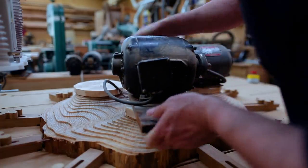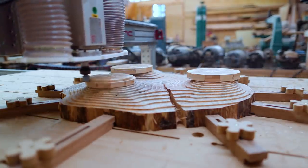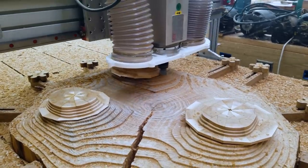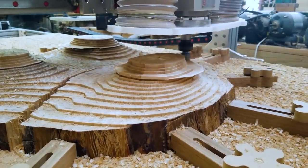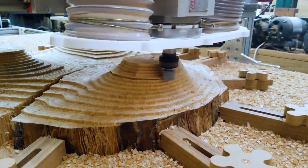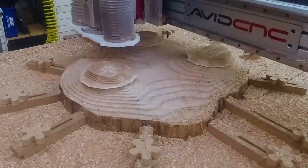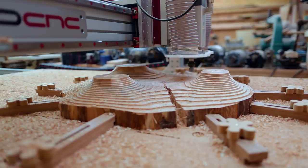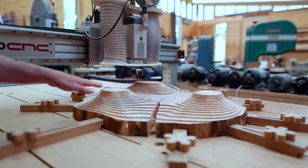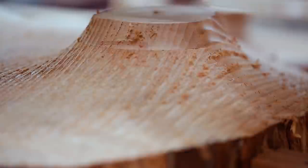Then I ran the roughing pass again. The first time it had been cutting air where the new material wasn't there, but now running it a second time it's actually hitting the tops of the legs I just made. Once I got through that new material I stopped the run — I didn't move the piece of wood, so everything is in exactly the same location. You can see it taking off the material and finding the shape within the circles I made. Once the roughing pass was done, I flattened the tops of the new rings, then did a rough finishing pass using a half-inch round-nose bit.